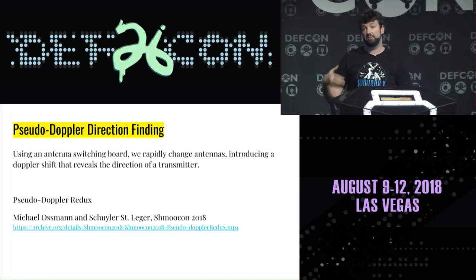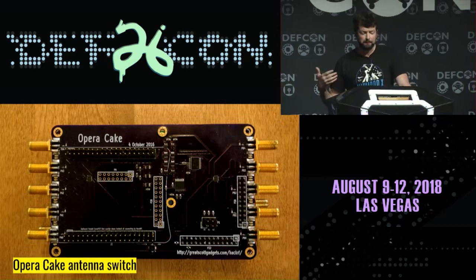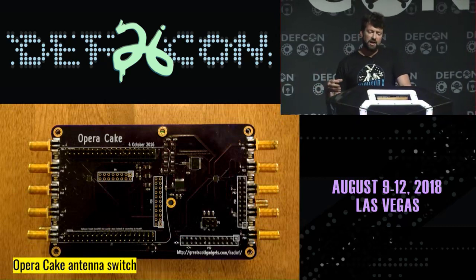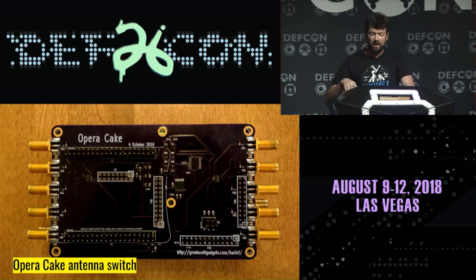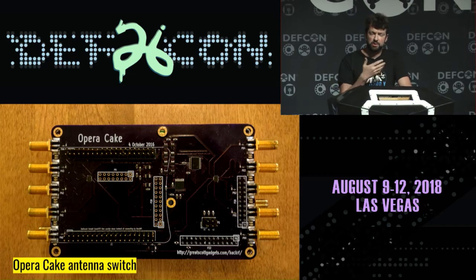But what you need for this is some hardware to rapidly switch antennas. So we built some. Now, this is called Opera Cake. It connects to both HackRF and GreatFET, and it can be controlled from firmware. So you can do various things with it. One is you can do pseudo-Doppler by attaching a number of antennas and very rapidly switching between those antennas.